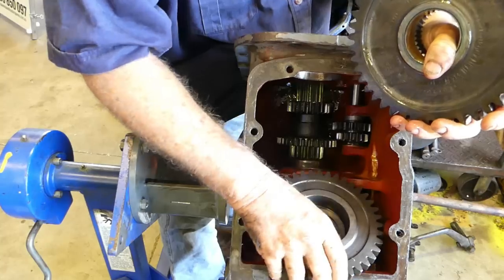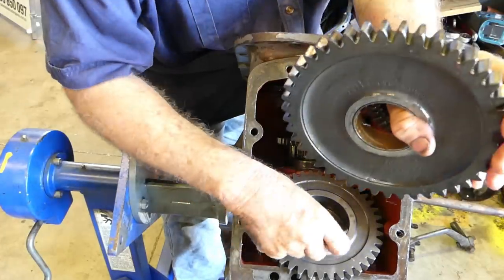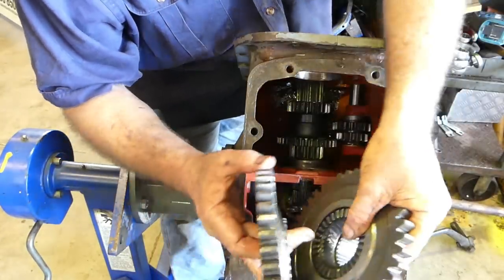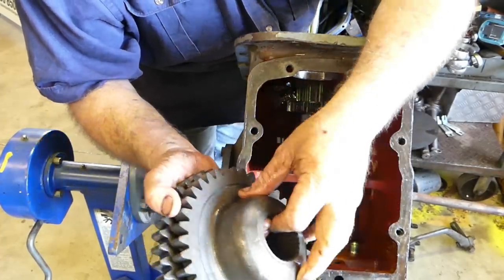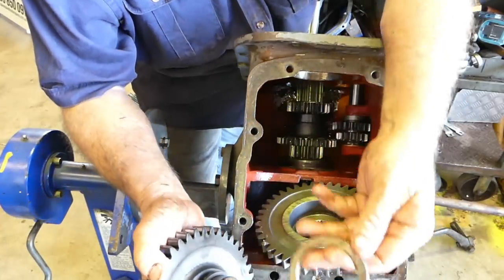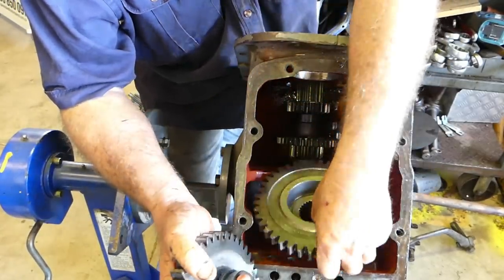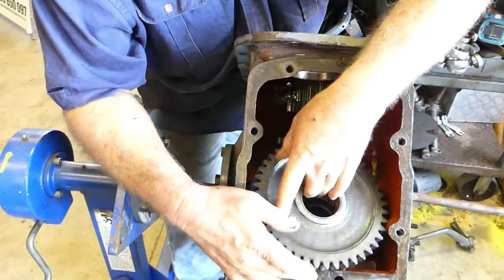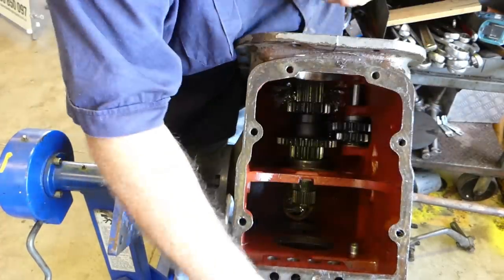And that bit there, that's a homemade piece. So what they try and do here is you have that spacer there, and that pushes on that, so this engages. When these are there all the time, that centre piece is engaged and it's locked solid. Normally there's a little spring in there. So what they've done, they've taken the spring out. The spring sits up the outside here, and they've just made that little spacer up to bypass the multi-power, so the spring actually sits in here and then over there, and you actually have to push on it. So I have to find a spring, but everything else looks okay. I'll keep that little spacer for reference.